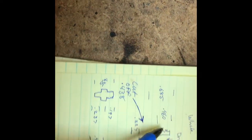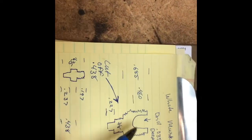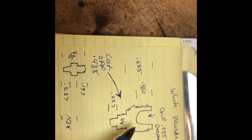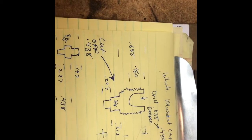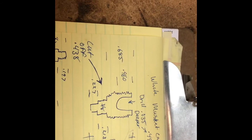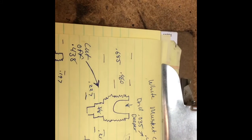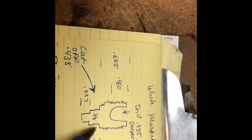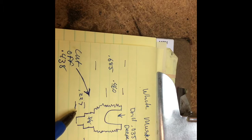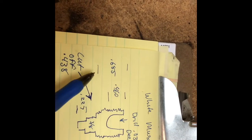Here are the dimensions, and this is for forum member Ed Mailey. The plug is 1.325 overall — I'll call it 1.33. The dimension on the hex is 0.213, the dimension on the nipple is 0.227, and the dimension on the threaded portion is 0.7.